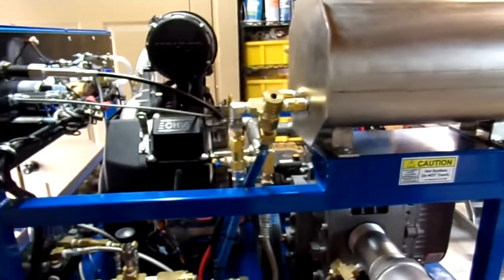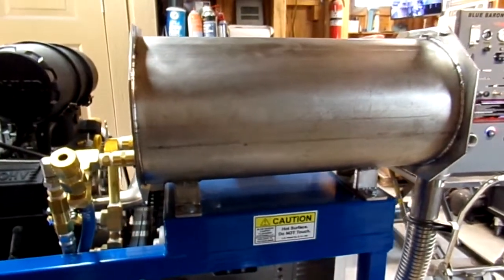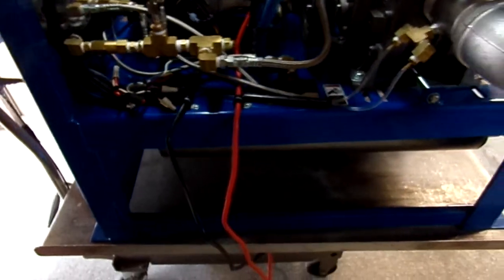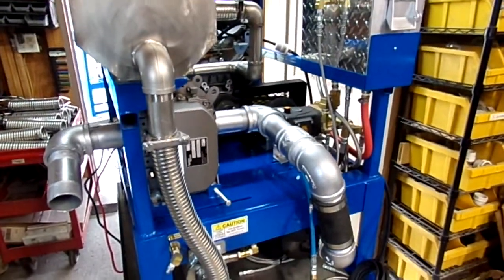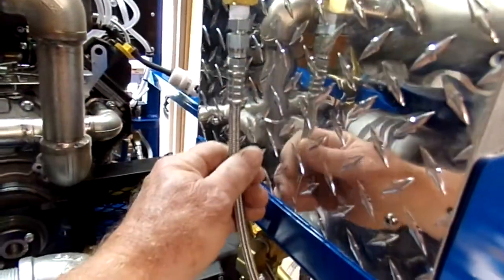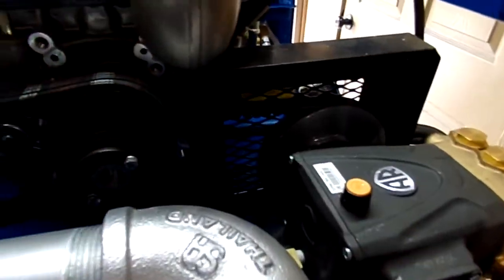The pressure for this unit is up to 3,000 PSI. On the 870, it's only 2,500 PSI. Our innovative patented heat exchanger is rated at 3,500 PSI, which allows us to go the extra mile on working pressure. We're not trying to fit into a corporate mold or bottom-line budgetary constraints. We offer a really super high quality unit — all stainless headers, open concept, all stainless, mostly braided stainless hoses rated to 500 degrees and 3,500 PSI tolerance. Everything is belt driven. It's just a beautiful setup.